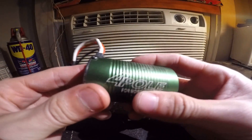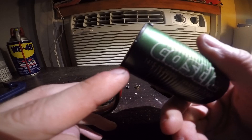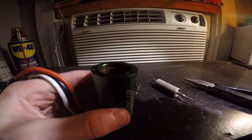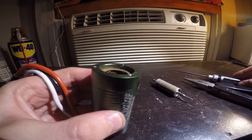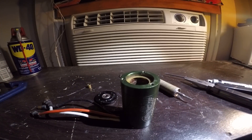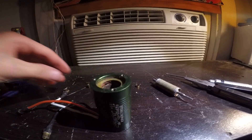Taking the back plate off can be a pain. Once the screws are out, you can use a knife to get inside that ridge and slowly pry it off, going around the whole motor. Or you can stick a screwdriver or Allen driver down the center of the motor so it hits the back plate, then use pliers or a small hammer to hit the top of that screwdriver — that'll knock out the bottom plate.